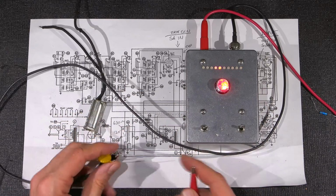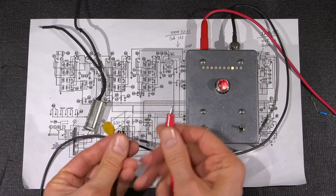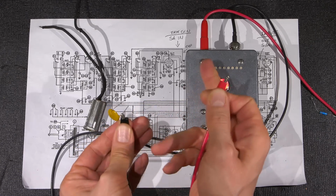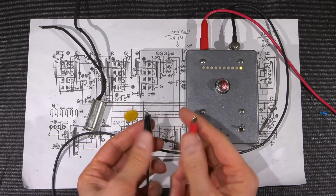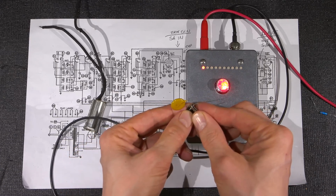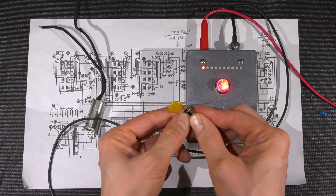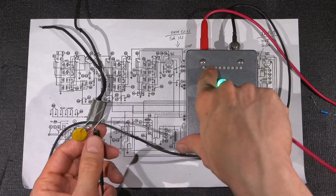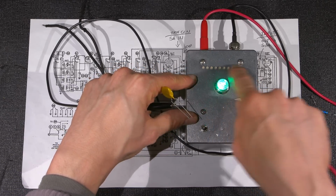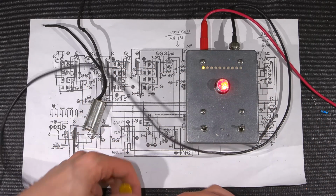The first scale is red, as you can see, when I'm holding these here. I'll bring it up to the yellow scale. The top of the yellow scale is about 1 billion ohms, okay? And if I short them together, you'll see that that's a dead short. So that's the start of the scale right there. Anything beyond this is about a meg ohm, and it works its way up to 1 gig ohm. The scale flips and it goes from 1 gig to 40 gig ohms, all right?